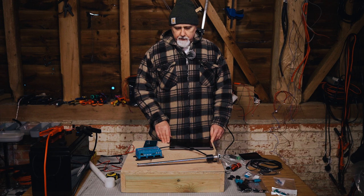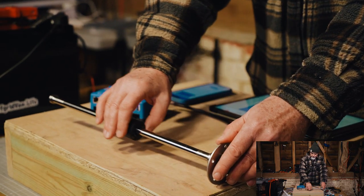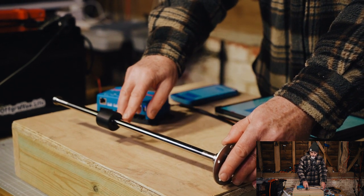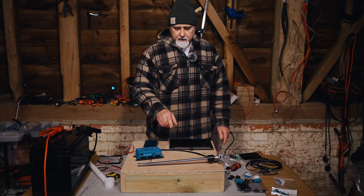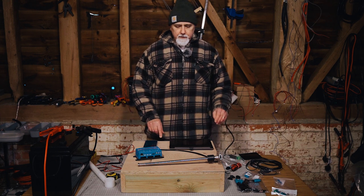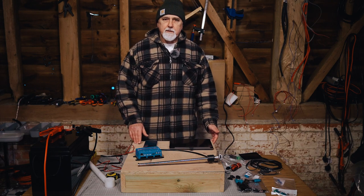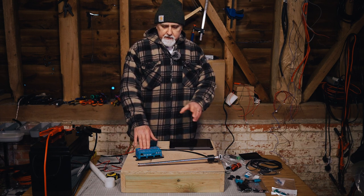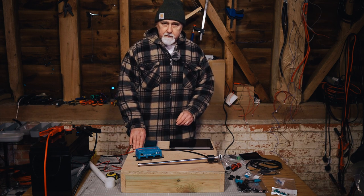What happens is this is a float, and according to the water level it moves up and down as you fill or use your water. This can be used in a number of situations — I think it can even be used in a diesel tank, but I'm choosing to use it in my fresh water tank. The sender is based on resistance. It's vitally important that when you're working with a CERBO GX, you do not use something that is actually going to pass current into the CERBO GX — you'll just blow the GX, and they're quite pricey things.